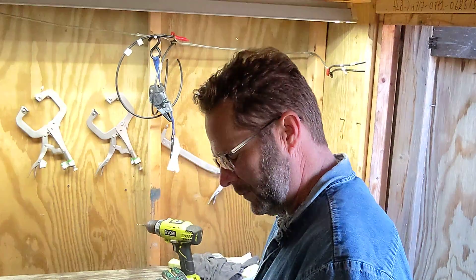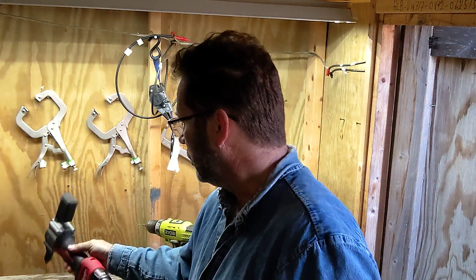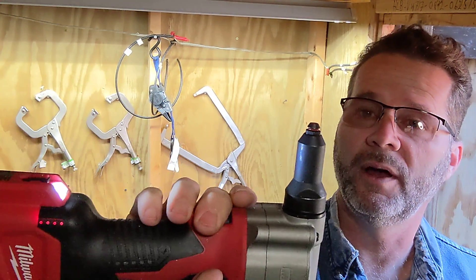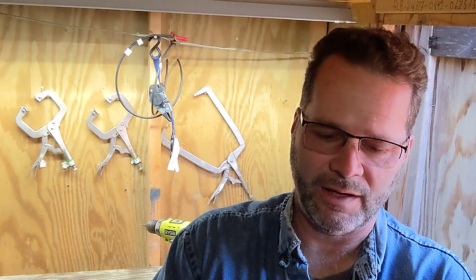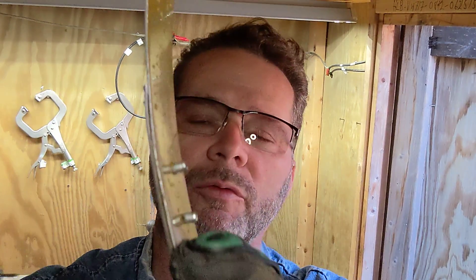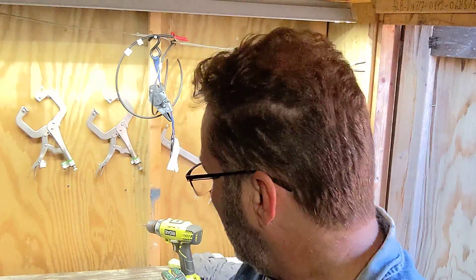The other method for joining these two together — let's grab another rivet and pop it through here. That's inserted. I've acquired this tool right here: it's the Milwaukee riveting tool. You just pull the button, squeeze the trigger, you can hear it cycling. It's a lot faster and gives me a more uniform pull with less moving around. And there it is — first pull, snaps right off real quick, real easy. Makes a nice uniform stroke on that mandrel and draws the two pieces of metal together.